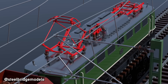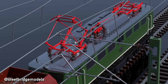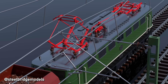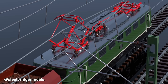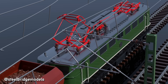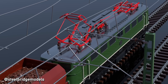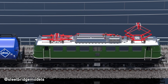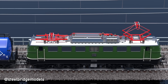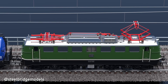To save the locomotive roof from this kind of dirt, it is preferable to use a pantograph at the back relative to the direction of travel. This also eliminates the risk of the unused pantograph getting damaged if the raised one gets torn off. Indeed, the use of the back pantograph accounts for the majority of trains. But there are various special cases — from dangerous cargo to icy overhead wires to double headers. In the case of dangerous cargo like easily flammable liquids, or sensitive goods like brand new cars on open transporters, usually the first pantograph is used to avoid abrasion or sparks from the pantograph hitting the wagons.